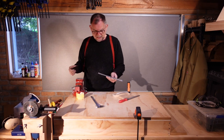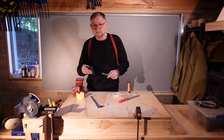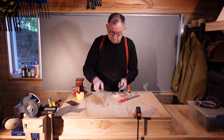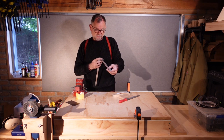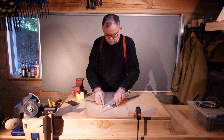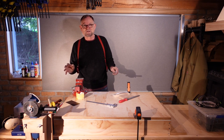After a lot of sanding, filing and scraping using the edge of the scraper that I don't care about, I now have this channel so that my calipers, when set at 10.1mm, will pass up and down the thinned section. Before we go on, I'm going to vacuum away all of the aluminium dust that I've just created.